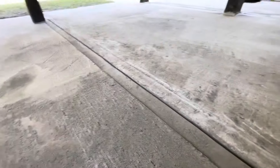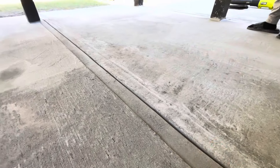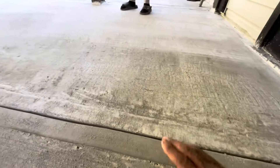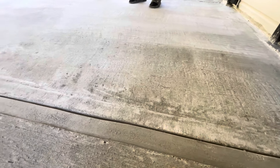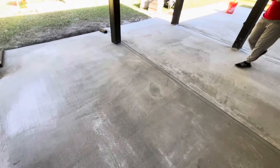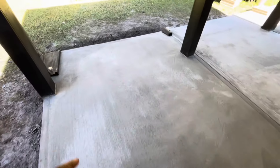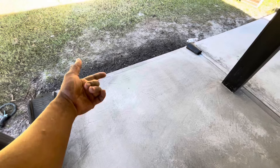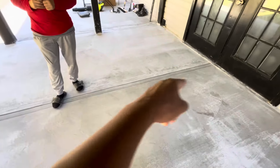This is something I love to brag about — a smooth transition, nice and level. I think that's very important when someone does concrete: it should be a smooth transition from one concrete to the next, not one higher than the other or lower. This is called concrete over concrete. Towards the end we added like an extra two feet that's strictly under dirt, but all of this on both slabs is a 14 by 16 foot pour.